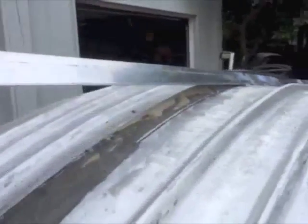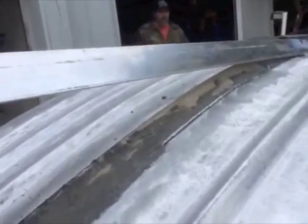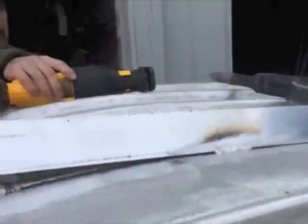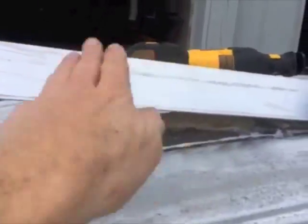Now tacking down the aluminum angle onto the boat. As you can see, we've got a straight piece of angle here and it's going to have to curve for the bow. So the next step is we're going to take our cordless sawzall, notch it a couple of places, then bend it and weld it.